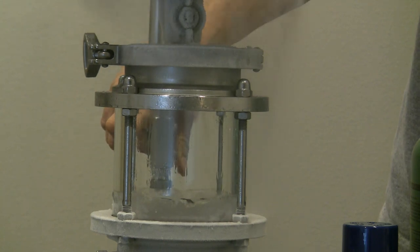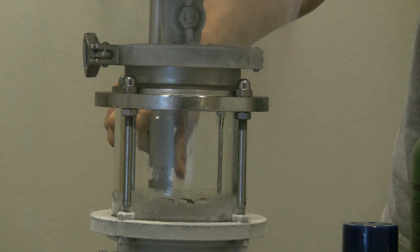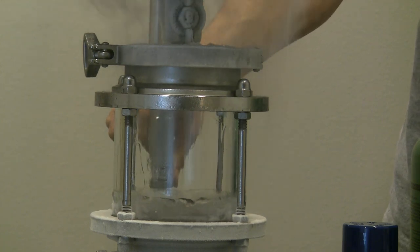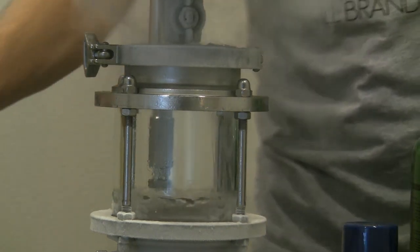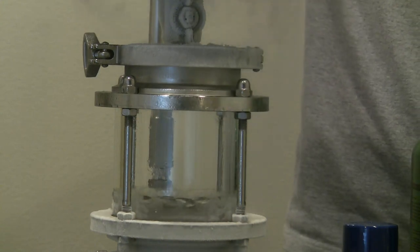The reason the device is smoking more is it's accepting the heat from the bottom, going up to the top, burning off that dry ice. Some of our clients have been tinkering around with the machine and figuring out some accelerated ways to recover the solvent. They've been recording a three-quarter tank recovery in about 4 minutes.